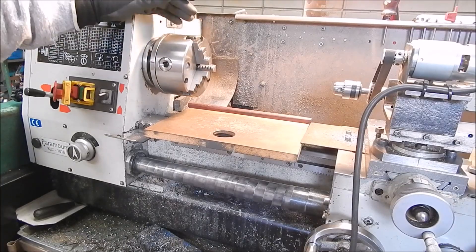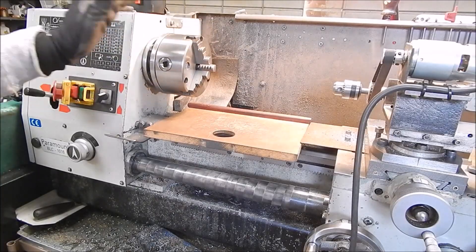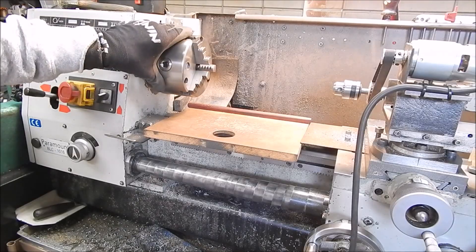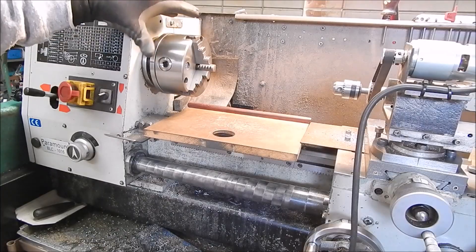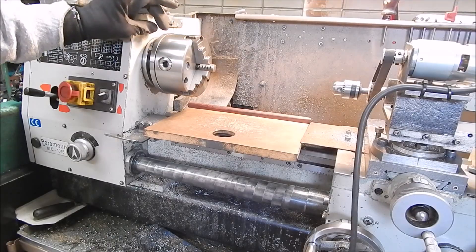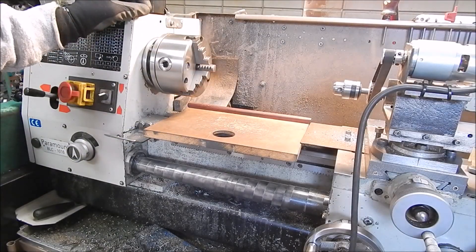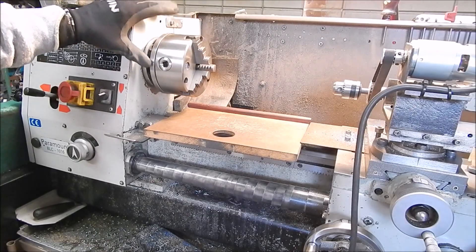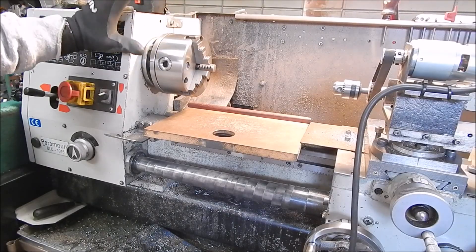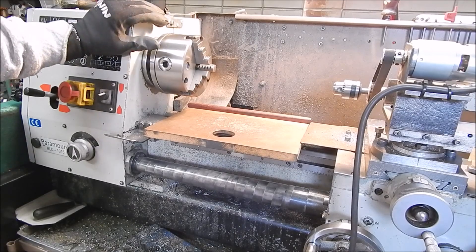This is another example of why you don't want to go too big with your lathe, for home use particularly. If you're going to be swapping chucks around, the last thing you want is a big heavy bloody chuck. Now this is a five inch chuck. The biggest chuck I'll go up to is six inch and that's enough. Once you get over six inch, you're going to struggle - it's gut-busting to change the chucks. Or you have to use blocks under them and slide them and it's a lot of fussing around. Small lathes have got big advantages as far as usability - you can easily swap over the chucks. It's no big deal. You could do it ten times a day if you had to, but you try that with a big lathe and you're going to absolutely spew.